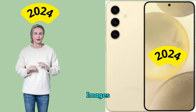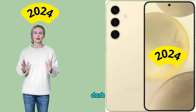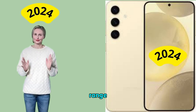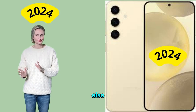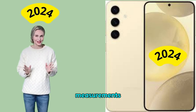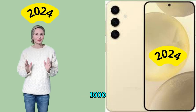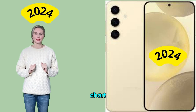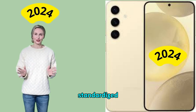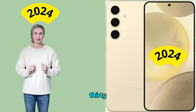For natural images, special attention is paid to noise on faces and landscapes, but also in dark areas and high dynamic range conditions. Noise on moving objects in natural images is also evaluated. Objective measurements are made on chart images captured at different conditions from 1 to 1,000 lux and different types of dynamic range conditions. The chart used is the dead leaves chart, and the standardized measurement is visual noise derived from ISO 15739.